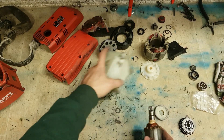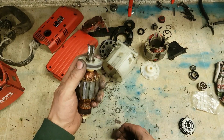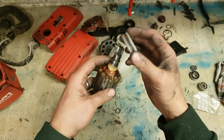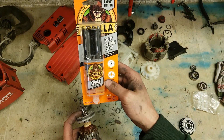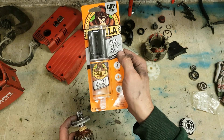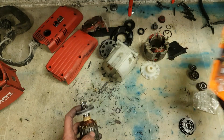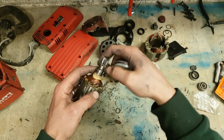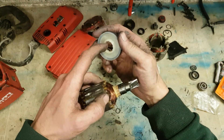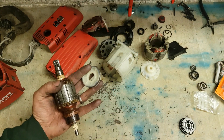Now that's her washed down. First thing we need to do is refit this tachometer ring. Because the teeth are worn out, we're going to have to glue it on. The thing I've had the most luck with is Gorilla Glue — it's a two-part epoxy, sets in about five minutes. Mix the two parts together with a toothpick, put it on the armature, more on the teeth, put the two together and let them set. That's what I've had the best luck with.